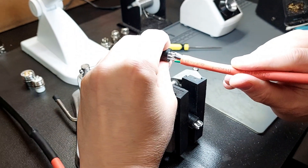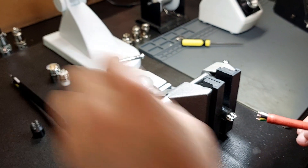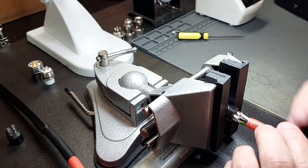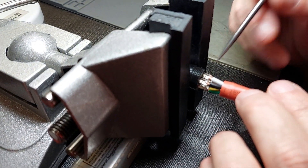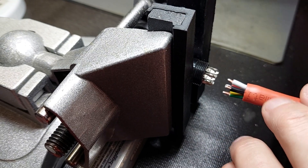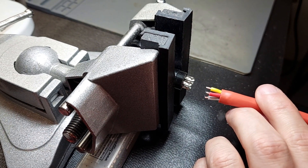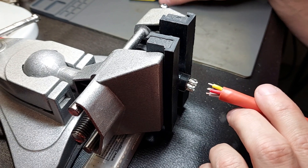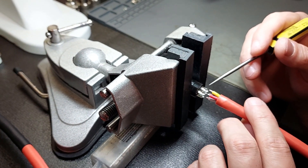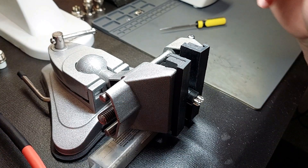With this new connector, going top to bottom, we would just align the terminals like this. I have one right here in the vise and I can show you exactly what I'm talking about. You have a conductor here, conductor here. Once these are tacked into place, you just rotate the connector again to tack on the other two leads. This is much easier — and what's really wonderful about this setup is the fact that once everything is soldered on, it's very easy to have a straight connector.